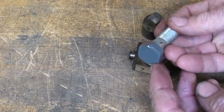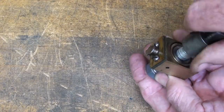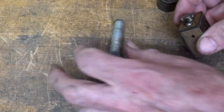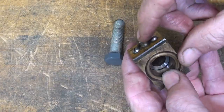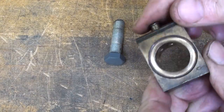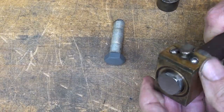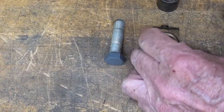Here's how this works — this is not the correct bolt, I'm just using it to illustrate. It goes through there, and once you get the machine into the position where it's the right length stroke, you tighten this down. There's nothing wrong with this. This bronze piece is really nicely made with little oil holes and it gets oiler on the top. Although it shows wear, I don't believe there's any real problem with it. It is a ¾-inch hole, and there's very little wear. I'm declaring this piece OK — and I'm glad of it, because that would be a lot harder to make than the other one.